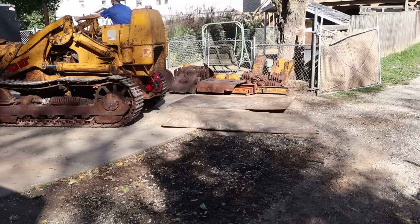So this is the fuel filter. Just a wound up ball of twine, really. And the fuel is forced to go down through it. And looks like in the middle, there's like a metal mesh. And then this shaft just goes right up through it and holds it all together. So I need to get four more of these, replace them. Even though these filters don't look bad at all. I saw someone else pull the whole fuel filter, and the whole square of all four of these filters were just really nasty. But these ones don't look too bad.